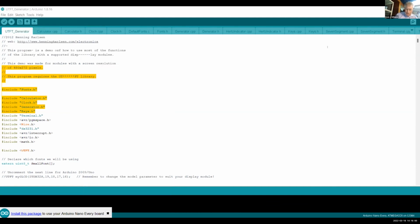After that, I go through a section where, as Catalin mentioned, there are variables, and some of these are called int. They are small variables. Of course, the Arduino itself is an 8-bit computer, but you don't have to have a number that's limited to 32767. But with int, it does. If you want a larger number, you have different choices. Here's double. You can have long. You can have word. But all the global variables are defined here. So that's another important keyword for you, global variables.